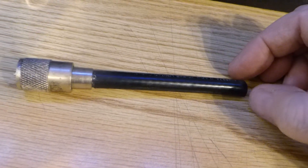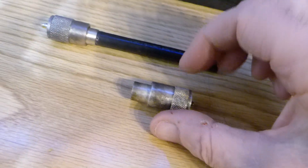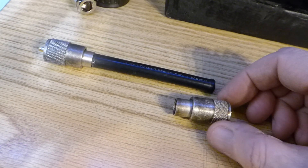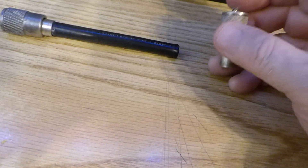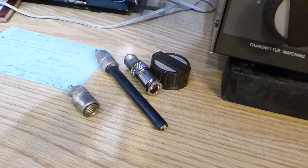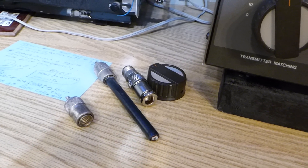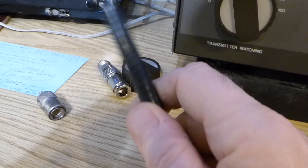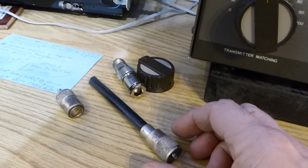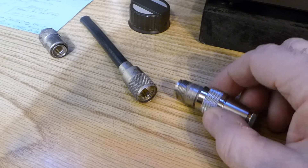So what I'm doing is making a couple of very short coax jumpers — this is RG8A and I've already started one, it's half done. I'm going to put Amphenol-type connectors on these, which fit on the back of the SA2060A just fine. The problem is the coax connectors on the back of this tuner are not as long as the old SO-239 type with four little bolts, so the shield doesn't get a good connection. I'll cure that with these short jumpers and a barrel connector.